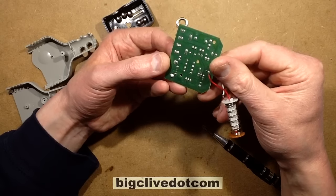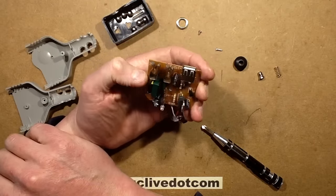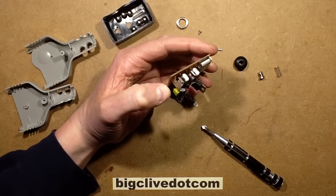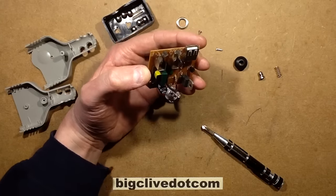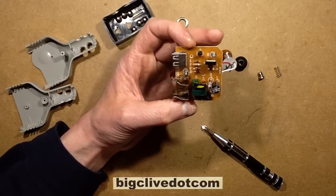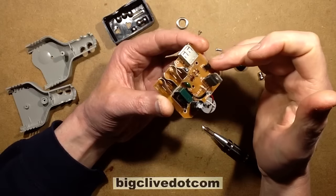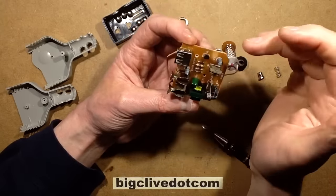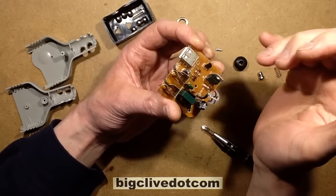There's really not much to it. I was expecting something more complicated — I was expecting something like a Royer oscillator, or even putting out high-frequency AC, which would have been bad news for LED lamps. So this would potentially drive things like LED lamps that have a switch-mode power supply in them, but it wouldn't drive any of the ones with capacitive dropper-type circuitry. It's odd that they've put this really low-current USB output there — if you plugged your phone in to charge, that little 7805 would get hot very quickly because it's a linear regulator. If you drew 100mA you'd get 5V out, but from 12V you'd be getting about 700mW dissipated in it — that's going to make it very hot very quickly.